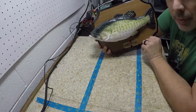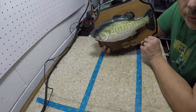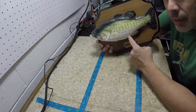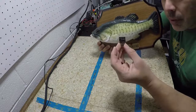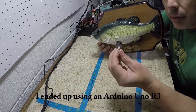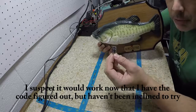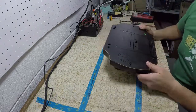This thing has two motors in it and a little controller. Some guy took a motor controller and an Arduino and used it to take over the motors. I'm thinking this thing already has a motor controller in it and I just have to figure out where to inject my signal with my DigiSpark ATtiny controller into the right spot. The idea is I'm going to take a stereo input into this little chip, and when it detects that someone is talking through the speaker, the fish mouth moves. Almost too easy - let's see what's inside.